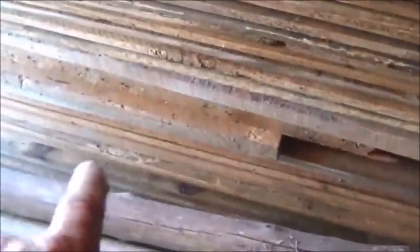And for the boards, I've got a few 2x4s stacked in here, but we ended up with right at 80 boards, actually about 82, 83 boards. And that's 1 inch by 12 inch wide boards. So laid side by side, that's 80 something feet. And the building that we're going to do is probably 8x12. So that's plenty of wood to cover the outside. This is not going to be structural anyway. Like I said, we'll put an overhang on it big enough to shed the water off, and plenty of wood for the siding, that's for sure.